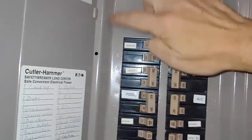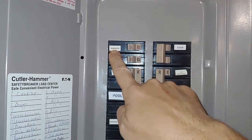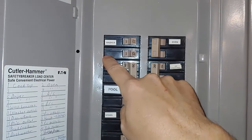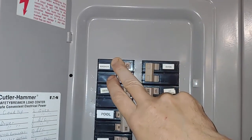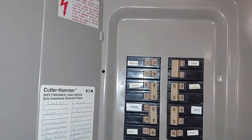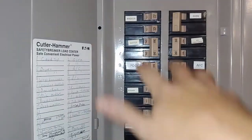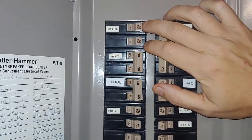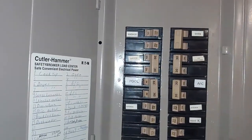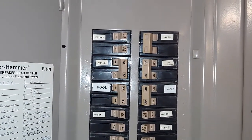There's a black hot wire wired into the first breaker in addition to whatever load is on it, and then the other wire comes in to protect the other leg. The reason it needs to be here is that when you get a surge from outside your house, the first area in microseconds that the surge would hit is there. It also protects everything inside for surges. The third wire goes to your ground bus — wired to the ground. Here's a diagram of that and how you would wire it.